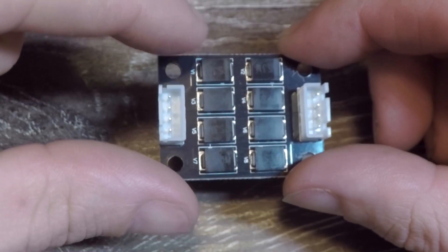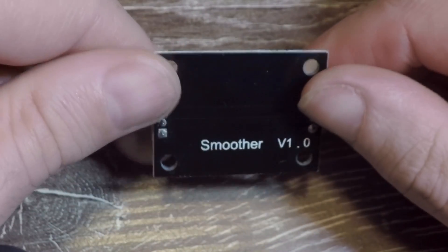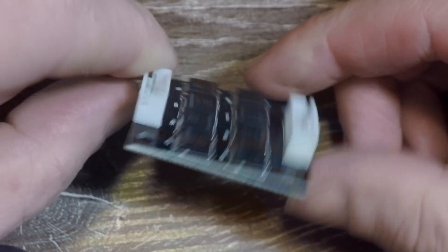These little things are probably one of the cheapest 3D printer upgrades you'll come across. They're passive components that plug in line between the stepper motor driver and the stepper motor. As their name suggests, they use 8 diodes to smooth out the signal from the stepper motor driver to the stepper motor, reducing the noise that you see on your final prints. There's a link in the description to buy these, and they're cheap enough that I have a bunch sitting in my drawer. If you're buying some, beware of the ones that only have 4 diodes — the ones with 8 diodes are meant to be much much better.